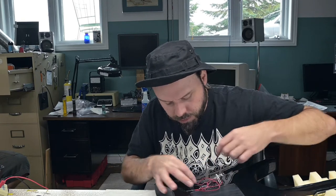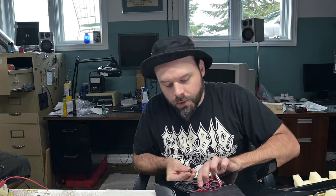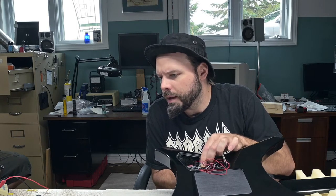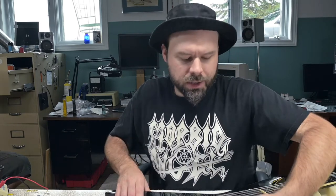Well, try it. See if it's distinctive when you plug it in. Because before I couldn't tell, and sometimes it would stay on the neck pickup, not the bridge. It's been doing a lot of weird shit lately. Well, yeah, because it's not engaging, right? Because if that thing's not seated properly, it won't make a proper contact from one to the other. This switch works backwards - it doesn't push contacts together, it pushes contacts away from each other. So unless it's pushing on the contact it's supposed to be, everything's just gonna get turned on.